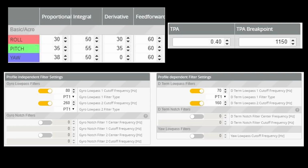And I think that without soft mounting the flight controller, there's not much you can do in terms of getting it better. And so, yeah, I think that they need to make some modifications to the design to soft mount the flight controller, and then obviously they need to send this out with an updated version of Betaflight with a complete set of tuned PIDs on there before they ship it out. Right now it just came with nothing, and I wouldn't recommend this for a beginner. But I think that someone that has some skills could possibly mod this on their own, soft mount the flight controller, and probably get some better results here. I just tried to get the best results I could with the way the hardware came to me without actually modding it. So this is what you're going to see.